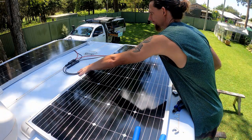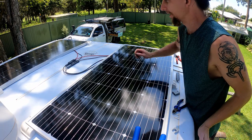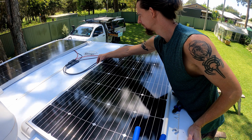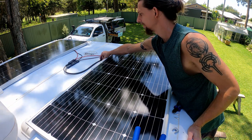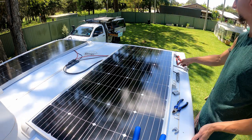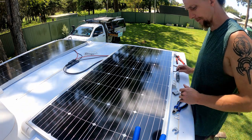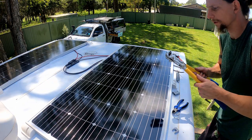I was going to run all these wires through a conduit, but I ended up buying this UV rated cable — especially UV rated — so you don't need to run it in a conduit. I think it'll be easier anyway, because I'd have to stop the conduit at the panel and start again, and it'll just get full of water. I think it'd end up causing more drama than is necessary.